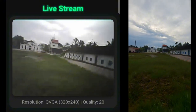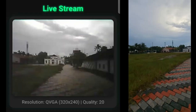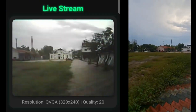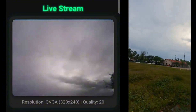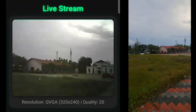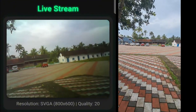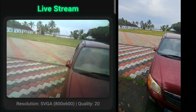Compared to the Wi-Fi version, ESP-NOW will have a longer range, but Wi-Fi will have a better frame rate and less setup hassle. If you want to fly a drone, I recommend using the Wi-Fi version. In low quality, high frame rate mode, you can get around 50 fps. In the highest quality mode, the fps drops to around 15 to 20 and the delay also increases.